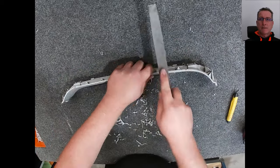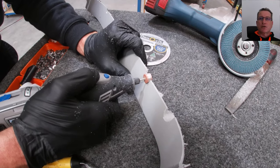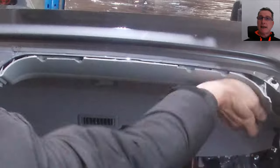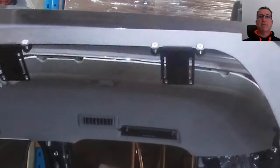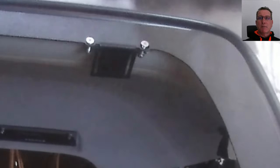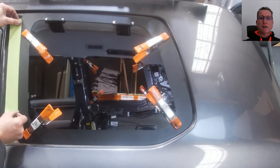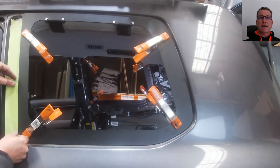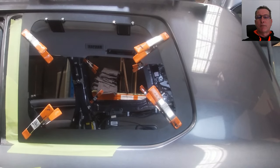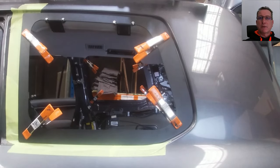The cuts are just about complete now. We'll move on to cutting where the bolts are going to sit against this trim — we've done the cutout for the support bracket and the bolts. Now we've got it all cut we can pop it back in place. Test, test, and test again — this is really important that this trim is back in place before gluing the frame. You can see we're getting the support brackets up behind the body and the frame in front. Applying some clamps — we're happy with the cuts. So now we're going to use masking tape to mark exactly where the frame is going to sit, and to aid us in cleaning up the glue later on. This goes all the way around the window.